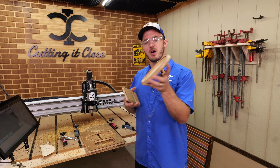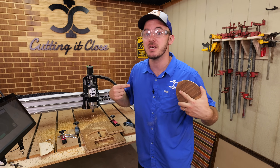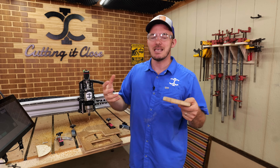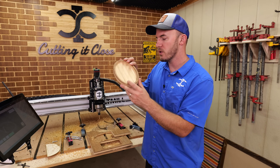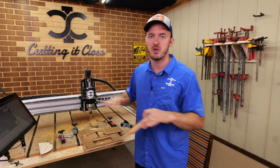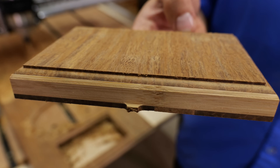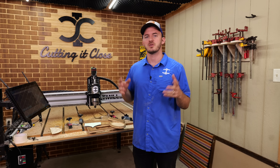We just popped it off and it is looking fantastic. At 0.177 inches deep for my particular CNC bit, that is the correct depth. For other manufacturers you'll just have to play with it and figure it out. I don't want this bit to seem intimidating — it is a really fun bit to use, it does things no other bits can do, and it makes your products that next level. Here's a side by side of the correct way to get that radius edge versus the incorrect way. If you do want a bevel look, just go deeper and you'll get a nice bevel.